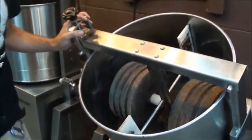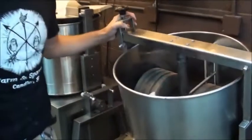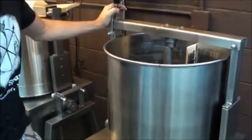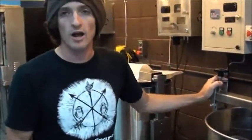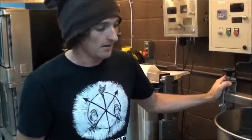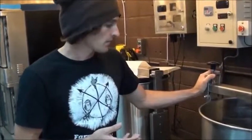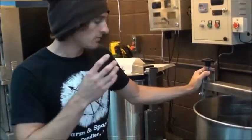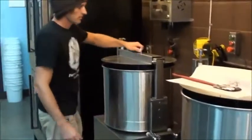the sugar, the milk powder, what have you, it gets ground against the wheels, friction heats it up, and because chocolate is a fat-based system, because we've cooked all the water out of it, and all that's left is protein and carbohydrates and fat. The triglycerides, the cocoa butter, is the operative aspect that controls the fluidity of the system. So once it gets up to a certain temperature, it becomes molten and just runs around in there. Here we see a batch running right now.